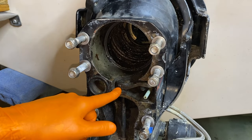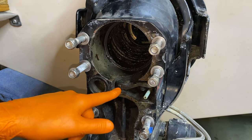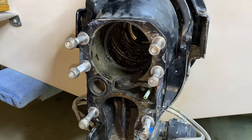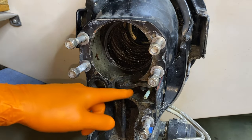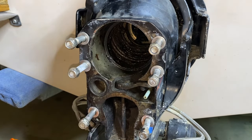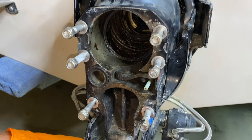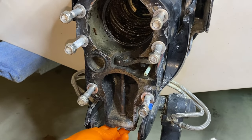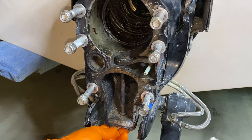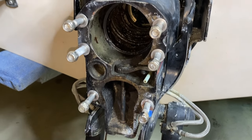I recommend taking a few photos prior to loosening and removing this screw because you want to document the orientation of how it goes back on, to ensure that the bottom tab will properly align inside the shift cable slide. There's also a slot down here for your shift crank that installs on your upper unit or out drive when it's all put back together. Photos go a long way.